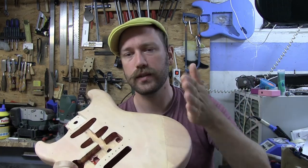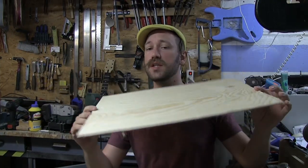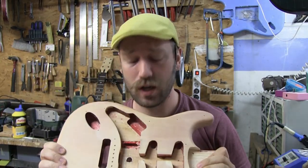I hope that makes sense. We also need to address that edge because what we're gonna do is apply this plywood sheet on it. I know some of you will say you can't do a top that is plywood, but first of all there's a lot of guitars that have plywood tops — even acoustic guitars. Secondly, this body is basswood, which is a very inexpensive body. If you have a nicer body and nicer wood, you can do what I'm doing with something else that is thin, like a thin top of nice curled maple if that's what you fancy.